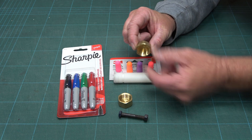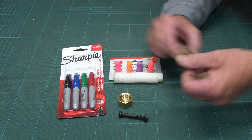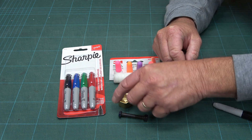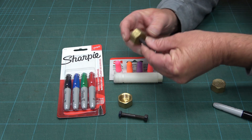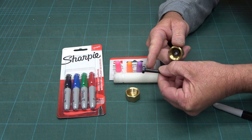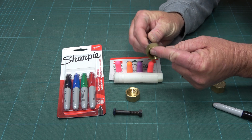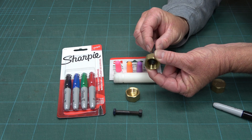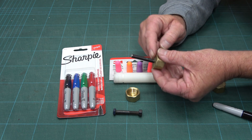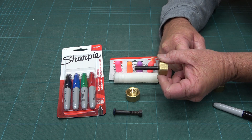Now with these end caps here, I'm going to put a hole in one of them, like so, and that's for the Sharpie to come through here. And the other one, I'm going to drill a hole in the center of it, cut the head off this bolt here, thread the hole that I drill, screw the rod into it, and put the nut on the other end. And that gives me the shank that's going to go into my router spindle.